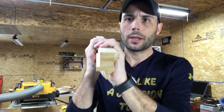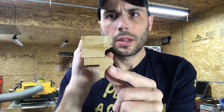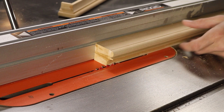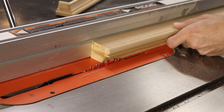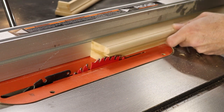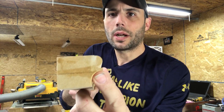We've got that piece trimmed off. Comparing the prototype to our blank, we've still got a piece hanging off here that needs to be trimmed. We move the table saw fence, eye it in, and raise up the blade. The plan is to creep up on this trim — first pass will probably just score it, then I'll raise the blade and make another pass, keep raising it until it cuts to the perfect height.